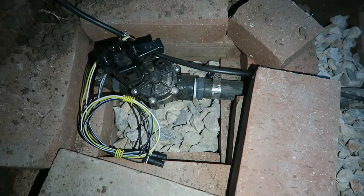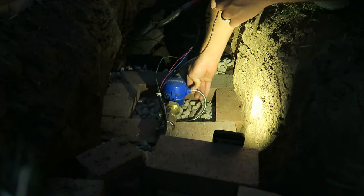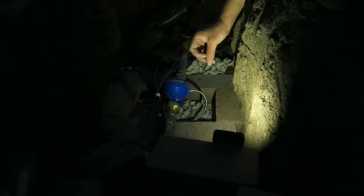This sensor has a little protector on it that keeps the wires from getting kinked — I just screwed that in. Out the other end we've got three wires: red, white, and blue. According to the instructions, white goes to common and blue goes to sensor 1 or 2, so I'm assuming it can go to either one, and red is not used. Since I'm already using the common wire for the master valve, I'm going to do red and blue — red to the common and blue to the blue.